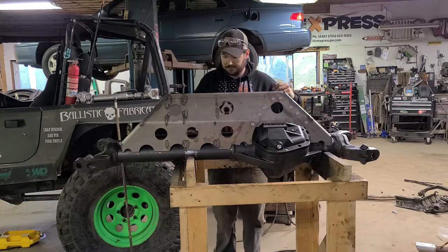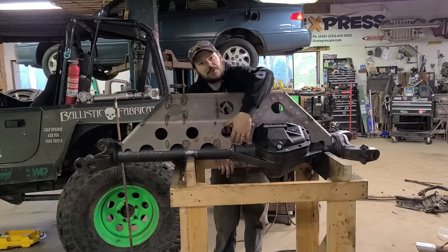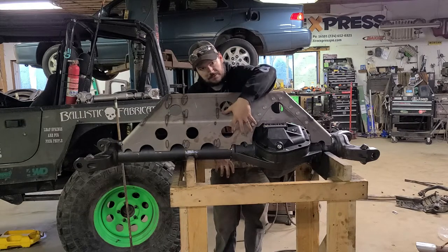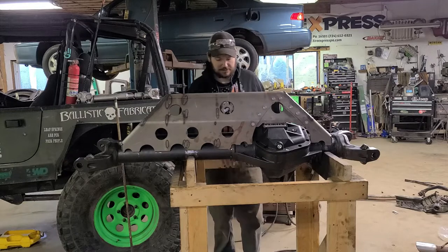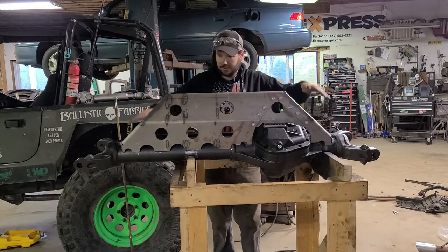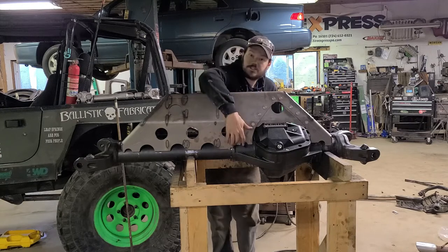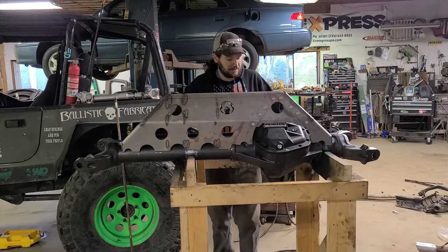Fits right on. I did have a little bit of warping — nowhere near where I welded, but it started to warp right about here in this area. This kind of came in a little bit so I've been massaging it to work around the casting. When I put it on there it kind of teeter-tottered back and forth. Shaved this area up just a touch and now she's sitting nice on both ends.